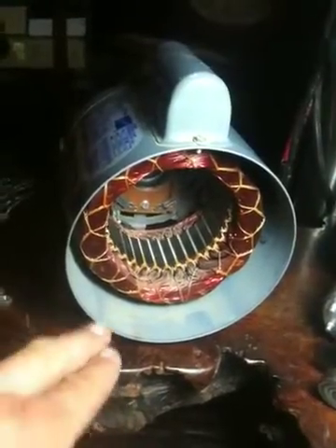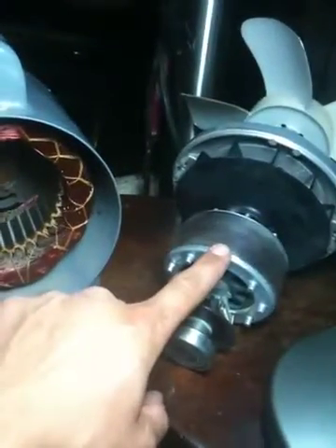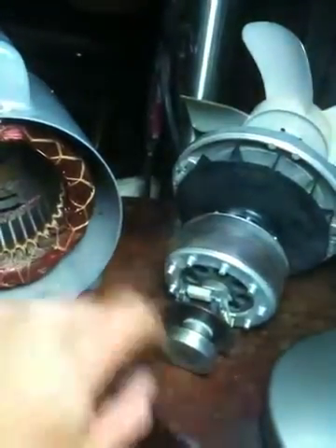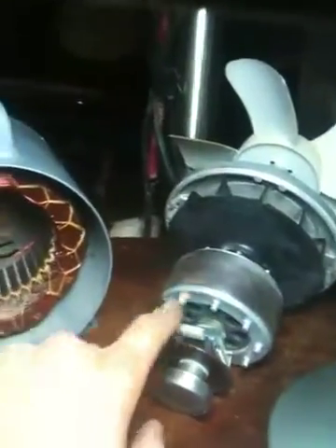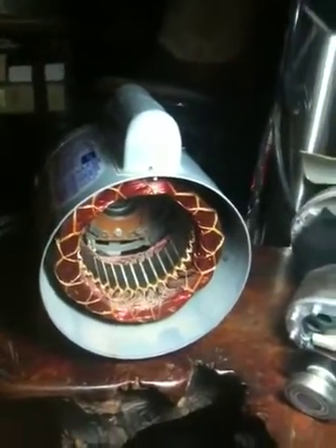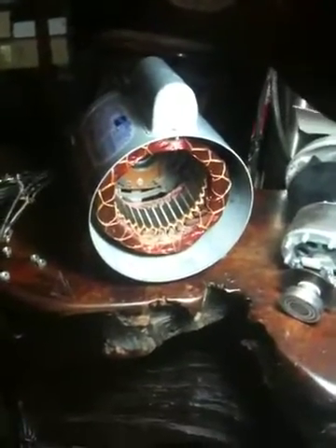The one I want to make is going to be kind of like a DC motor connected to a coil configuration such as this, but this rotor wheel is going to be a square or bar magnet with the ends curved so it can rotate inside here. Imagine a south pole here, north pole here, connected by a rotor like this. It's going to be another DC motor that has four circuits following the four coils. This will be a demonstration rotating magnetic field motor — I'll see what I can do and post another video as soon as I can.